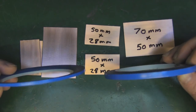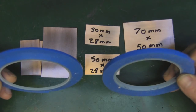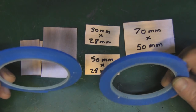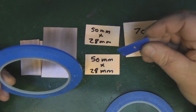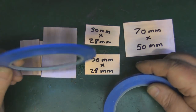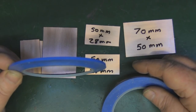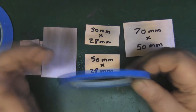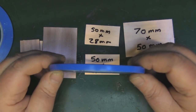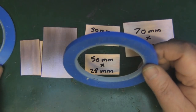The other thing you're going to need is some vinyl tape — you can pick this up off eBay pretty cheaply. Mine even came with a little cutter and a spudger to get all the air bubbles out. I've got some here that's 3mm wide for the parasitic elements, and for the back reflector and the driven elements I've got some 5mm wide.